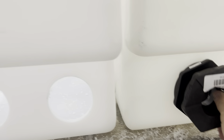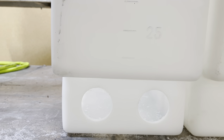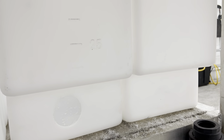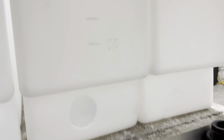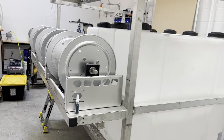Check out some of the other videos I've posted. But you may be asking, why do we have three holes? Well, I'm going to walk you through this. Basically this one's going to go in here and then we'll jump over to this one. So these will be tied together and then this one will be our drain. By tying two tanks together instead of using one 200-gallon tank or an IBC tote, we eliminate some of the slosh by having two water tanks. As one fills, they both fill together. And then that back tank — we don't do any bulkheads in our bleach tank. That's going to be a hundred gallon. This was a used skid that we got a hold of, so we're just kind of rebuilding it out. But yeah, that's how we're going to set up our tanks.